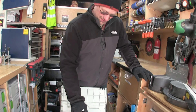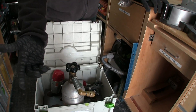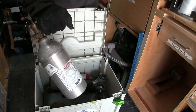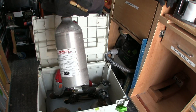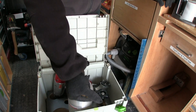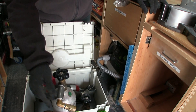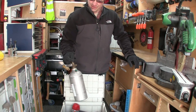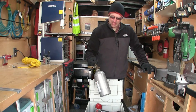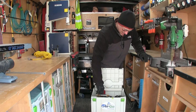The 100-pounder is much more cost-effective. CO2 runs between 700 and 900 pounds pressure and it expands — I think somewhere around 700 times when it hits the atmosphere. This valve brings it down to 110 pounds, and from this little bottle I can trim out an entire kitchen of crown molding, base, and miscellaneous moldings on one bottle. It's actually pretty impressive what you can get out of it.